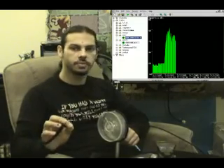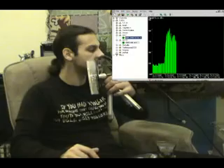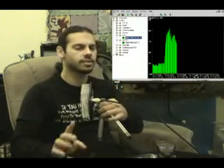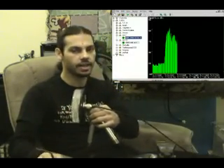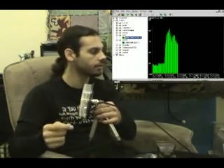By having 0 decibels, which means you have 100% signal, you're losing nothing. Right now, this antenna should be giving us 6 decibels of gain. Every 3 decibels, you double your signal quality — you double your power.